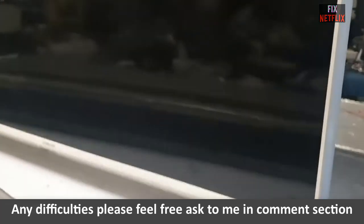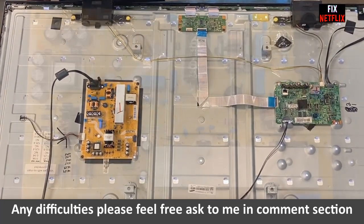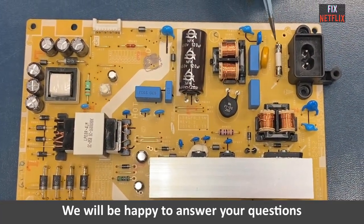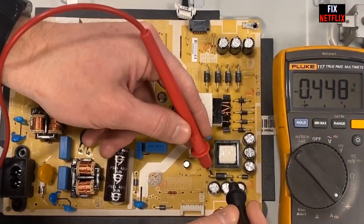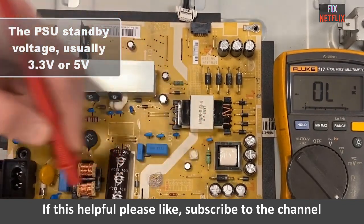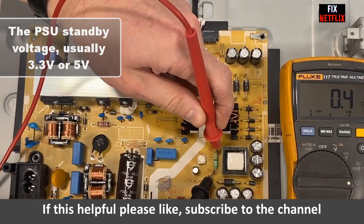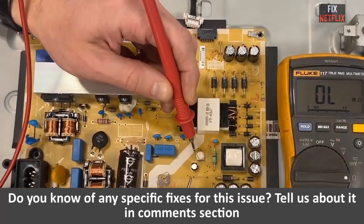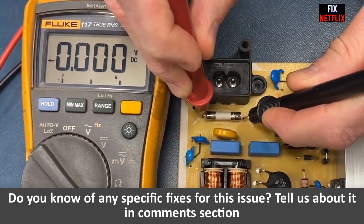Let's start with some basic diagnostics. First, check if your TV's power supply unit, the PSU, is providing any output voltage. If there is absolutely no voltage output, try disconnecting the connector from the main board and check if the PSU standby voltage, usually 3.3 volt or 5 volt, is present. If there is no standby voltage, the issue likely lies with the PSU board and not the main board.